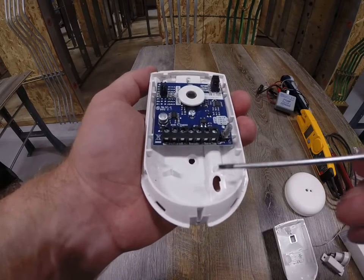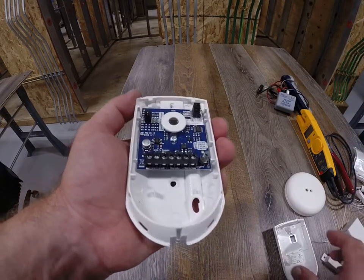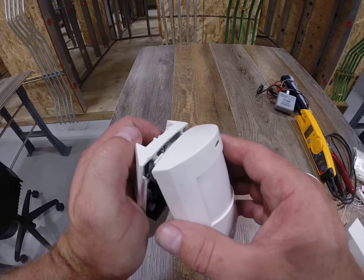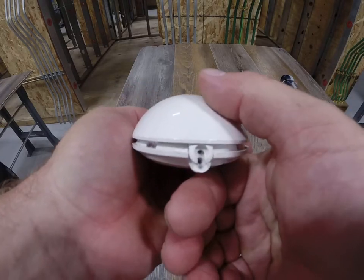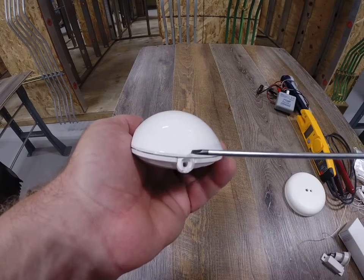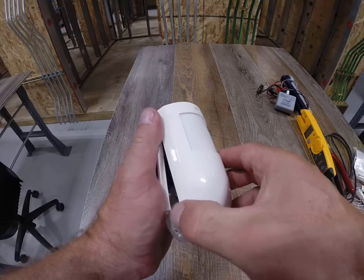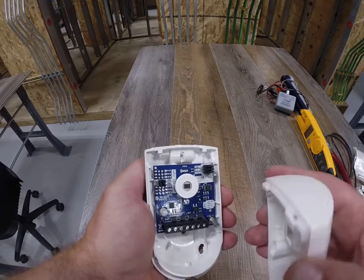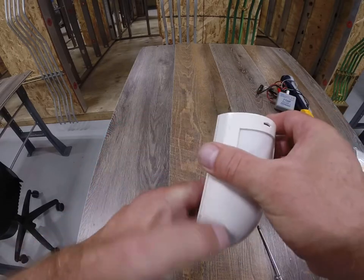The important part is when you're wiring it, we've got to be careful — we're going to need tiny little screwdrivers and very patient hands. When you put the cover back on, you've got to get these tabs to fall in like that, and then once they do, it will snap back into place. You won't need the screw that it came with because it's got a good snap action. To open it again, twist your flat screwdriver, take your hands, and very gently be aware that it's going to pull down. Remember, you want to be careful not to jam these jumpers or break the tabs.